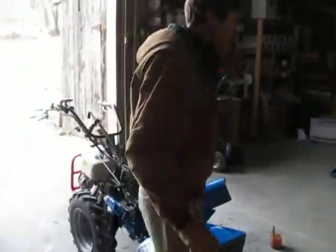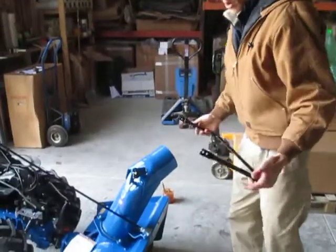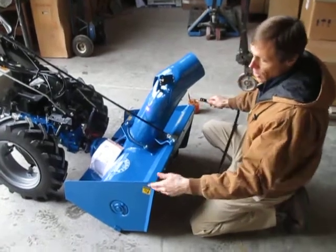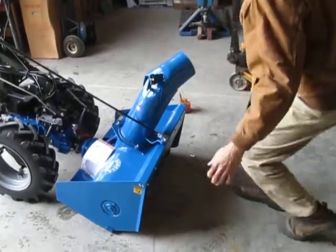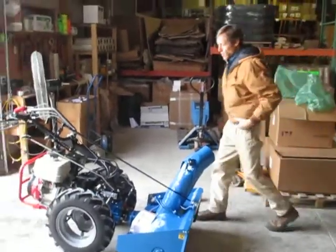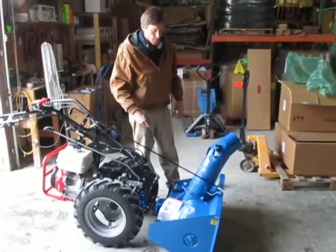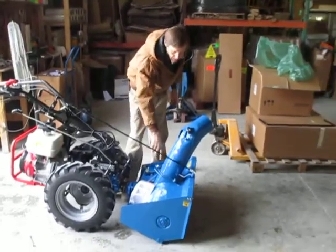That's about it. There's also a guard which comes in the box with the snowblower. This is just a safety thing — some people don't put these on, but it's a nice idea because it keeps small children from running in here quite as fast. You take out these two little bolts on each side, bolt this guard on, and put the bolts back in. It's just a knee catcher there — you know, smack your chin and walk up front of the thing. Those safety things are important, so you want to put that on. As far as greasing the crank rod, as you slide this thing back and forth for months and months, if it gets a little stiff, you can take some good spray grease and spray around this to keep it lubricated. You don't want it to get rusty.